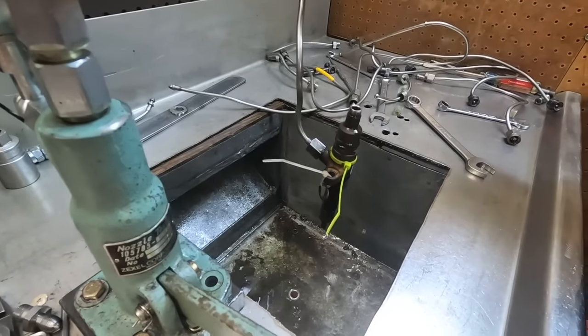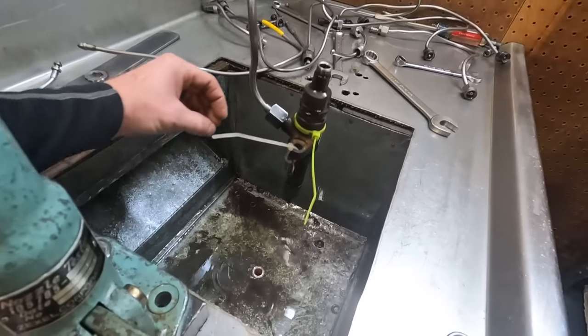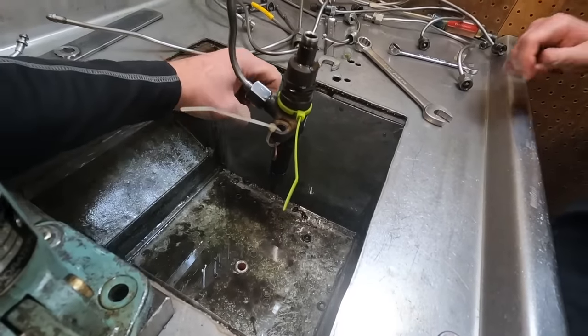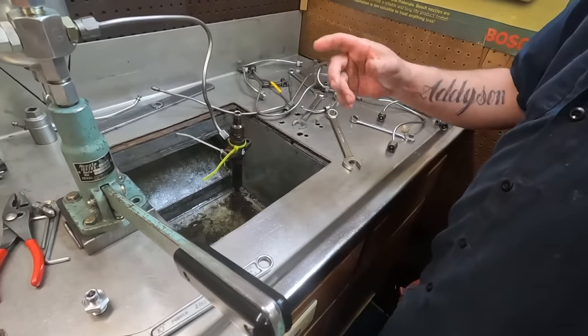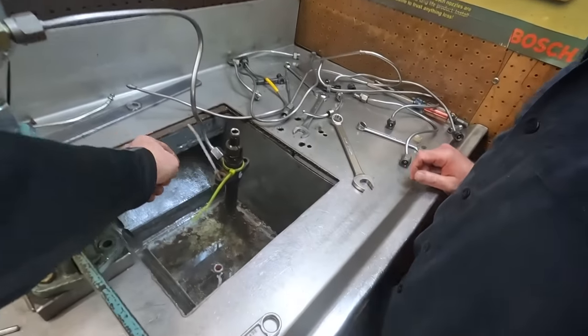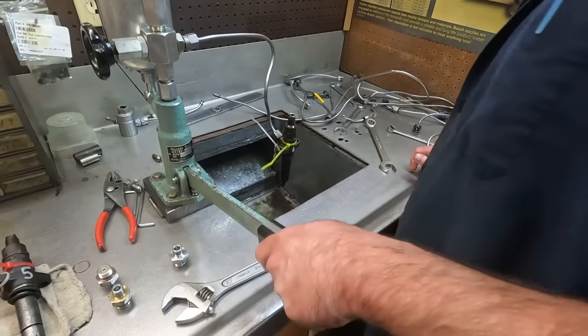And you can see that one. It seems like it's atomizing fuel. So basically, at the end, are you looking at how misty it is? Yes, not so much the spray at the tip, as long as it's misting. Okay. That's a good word to use. Versus there, that one was more of a stream. Yep. It's a straight line, you're not atomizing fuel.